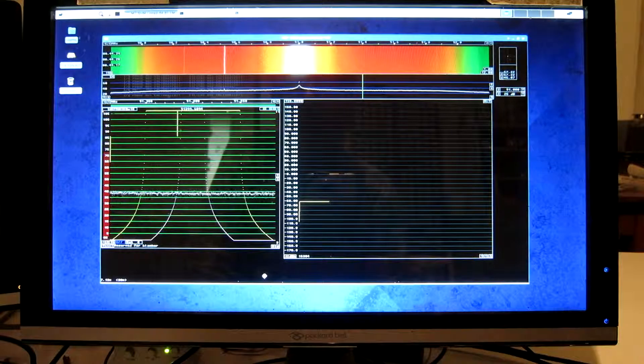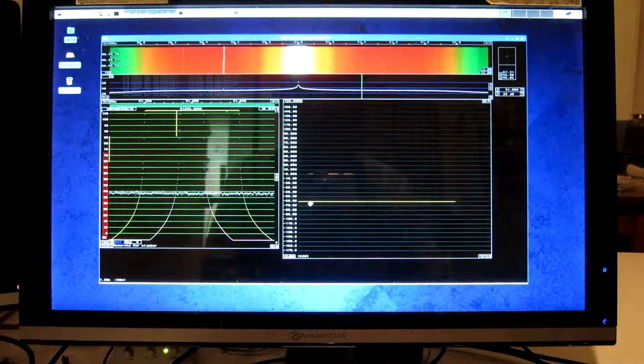That is 100,000 times 1 hertz, which is 50 decibels. So the signal level should now be minus 124 dBm if the noise figure had been zero on this dongle, but it is about 8. So I have to add 8 to minus 124, which means minus 116.